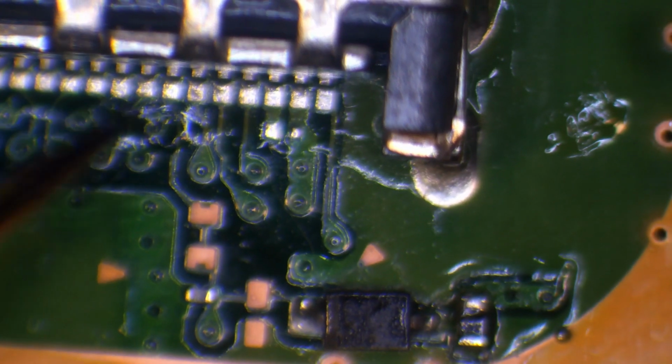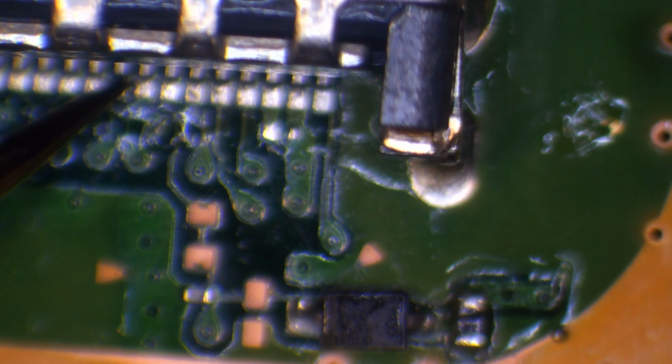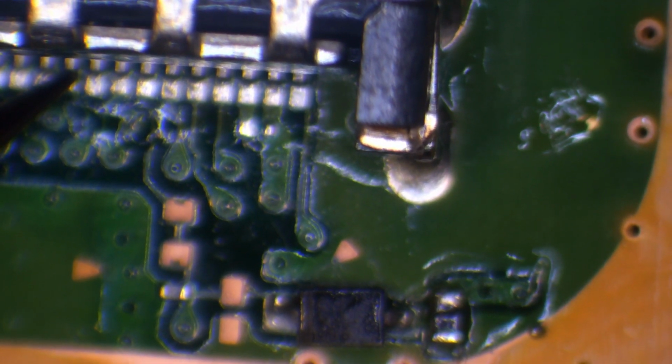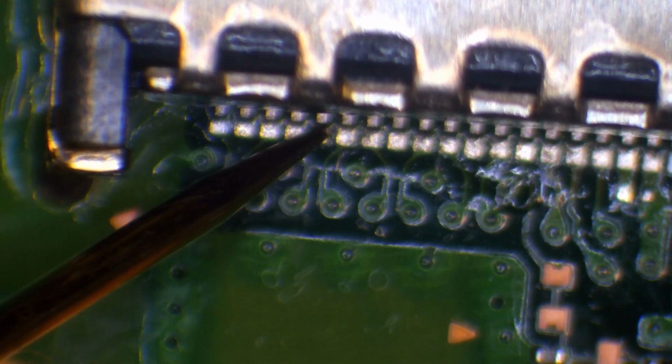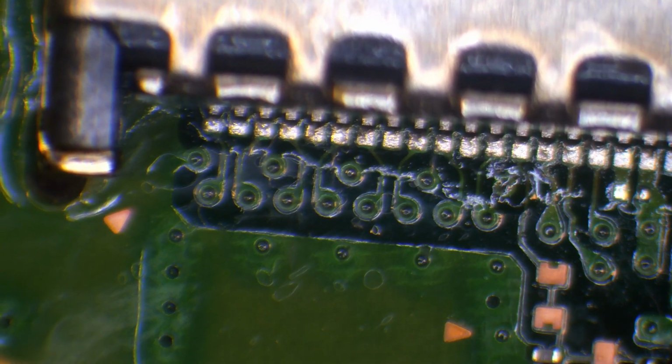This is the differential pairs, I think. Is it? Are we at the differential pairs yet? I think so. 0.796. That's ground. Should get the same on all of these. Yeah, getting the same on all of them. Yeah, the port's been changed, the small cap's missing, but that wouldn't stop it from turning on.